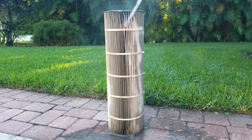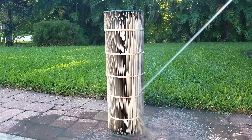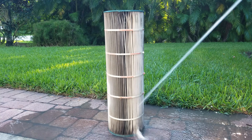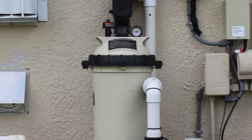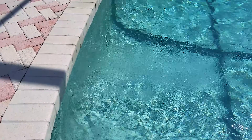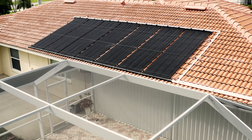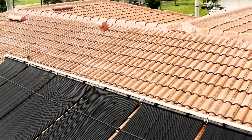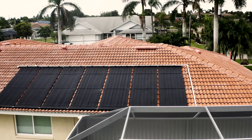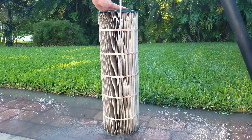The solution is simple: clean your filter regularly and thoroughly. Cartridge filters get clogged and eventually need replacement, and often filters do not get adequate attention because it's a time-consuming and sometimes difficult process. One test you can do is to remove the cartridge and replace the lid, then run your system and see if the bubbles go away. If so, you need to clean or replace your filter. A dirty filter increases pressure on the pump and restricts flow, resulting in less pressure in the solar panels, which causes the vacuum relief valve to open and admit air into the system. Keeping your pool filter clean is a good idea anyway, but becomes more important now that you have a solar pool heater.